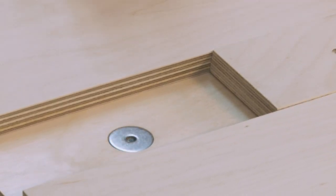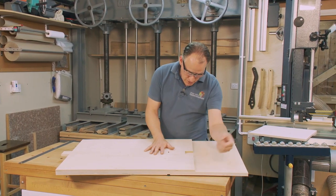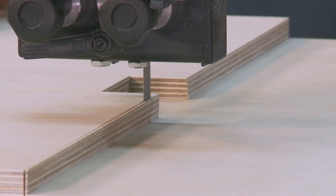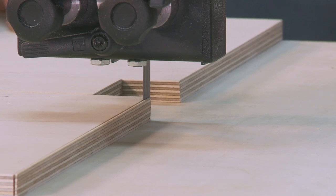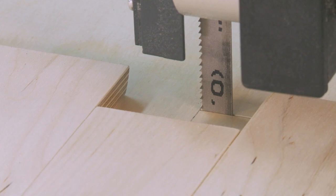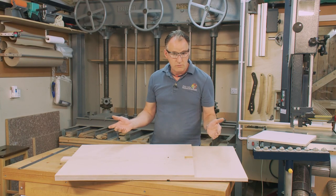What we're also going to have to do, because it's the first time this jig has been used, is put this on the bandsaw to cut a kerf and a slot into my plywood. I want to try and get it set up so that the front edge of the blade, or within the gullet, is in the centre of my circle. If you don't get this centre line lined up, you won't get a circle - it'll cut a spiral, which is no good for us.